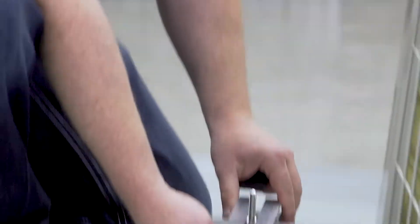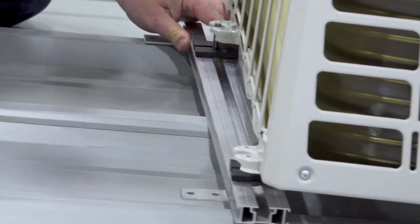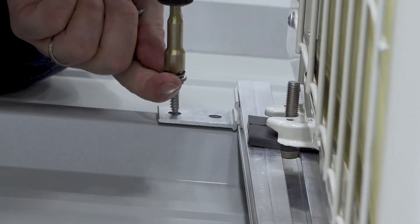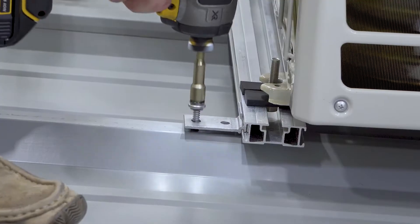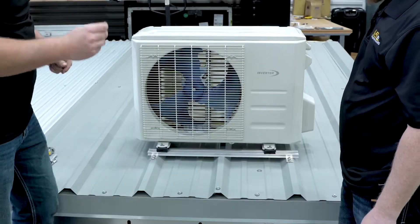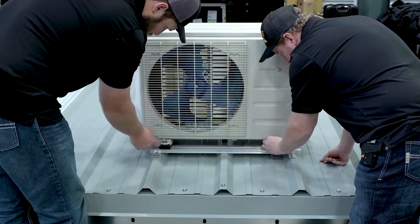Now we're going to start moving things into place. Set our unit on our front strut, get our spacing nice and good, then pick up on the unit and install the back piece of strut. Slide the tabs into place and rinse and repeat from the front — we're going to install our four S5 piercing fasteners into the roof. Now that we've got our GripperFix struts and unit in place, we're going to install a few washers on top, then install the S5 serrated M8 nut on top. Ratcheting wrenches are recommended.